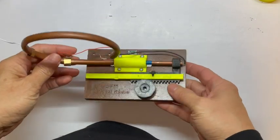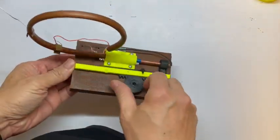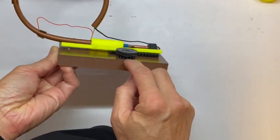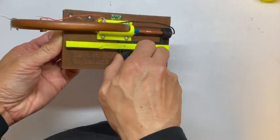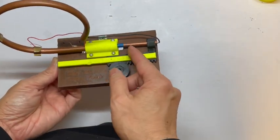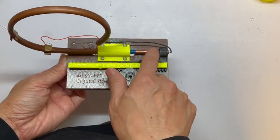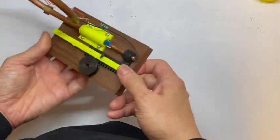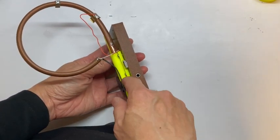Now this is the completed Scorpion FM crystal radio. You tune by turning this knob, which has a spur gear that drives this red gear. It drives the 5 millimeter copper pipe to go in and out of this 8 millimeter curved copper pipe. There's a drinking straw made of plastic to insulate the moving pipe from the bigger copper pipe. So by moving it in and out you can tune, and this thinner pipe connects to the tip of this G-shaped coil as a variable capacitor moving plate.